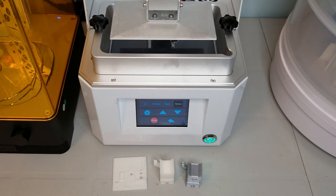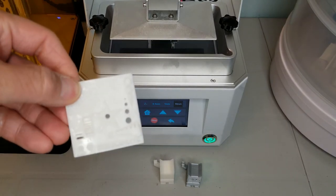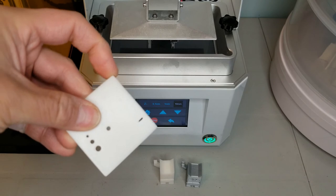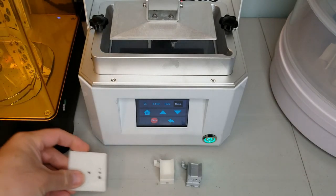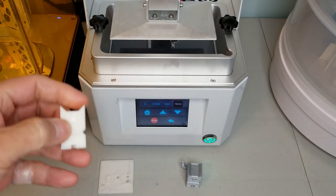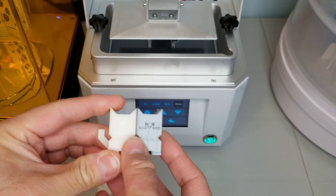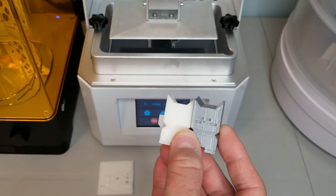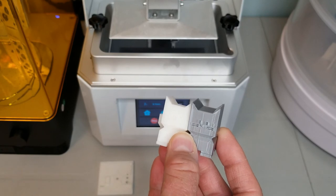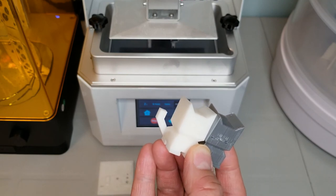Now for the prints it produces — keeping in mind I had no idea of the proper settings for this printer with this third-party resin, I printed a test file that came with the printer using Mingda's default settings. It actually came out pretty well, but was probably overexposed from the bottom layer, which made it really hard to get the print off the platform. So after adjusting the settings a bit, I printed this CaliCat, one of my favorite test prints. You can compare it to the one I got off a Mingda Rock 3 FDM printer — made by the same company. It's clear that the resin one has much better details without any visible layer lines. The settings still need to be dialed in more, especially with wash and cure times, so you can expect quality to be even better than this.